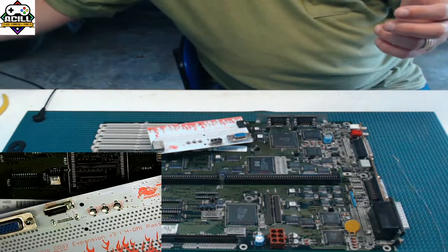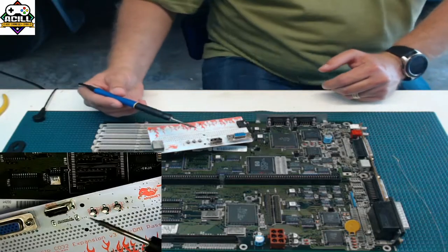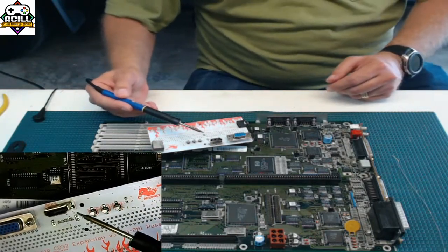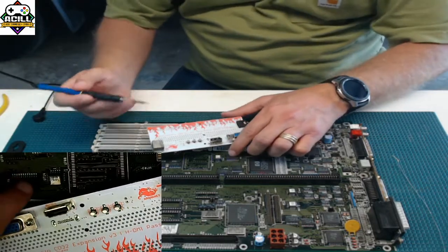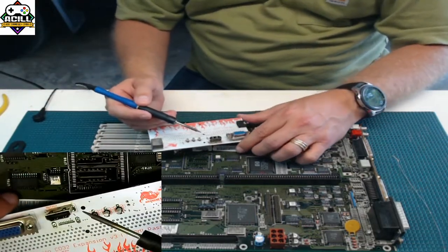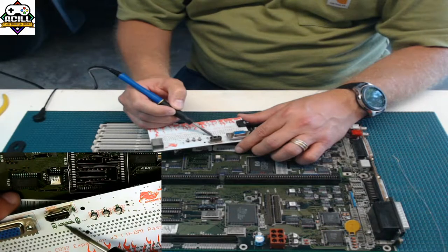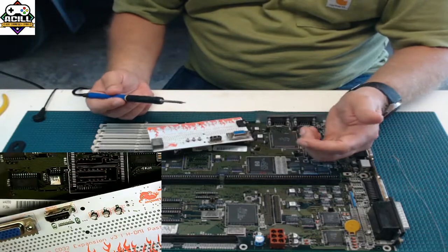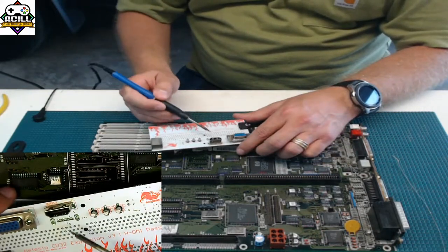So that's where something like this soldering iron comes in. This, and Steven in here knows what I'm talking about, is a 2032 from Hakko. All my stuff is Hakko. And it's a micro soldering pen. And if you notice, it's much smaller and much easier to get into. So that's one way that you can use a surface mount and solder much easier.